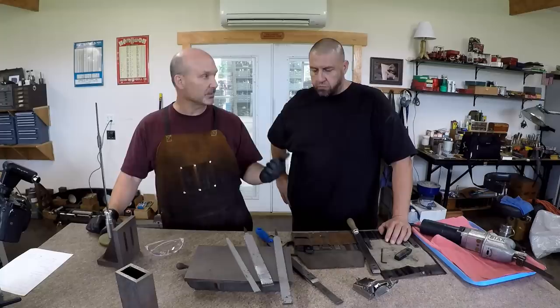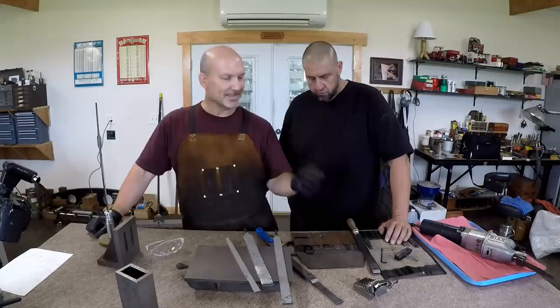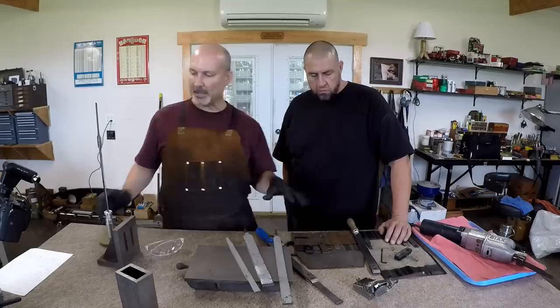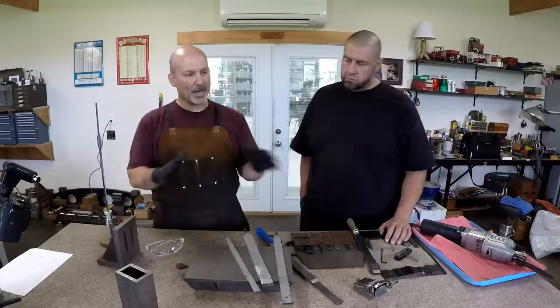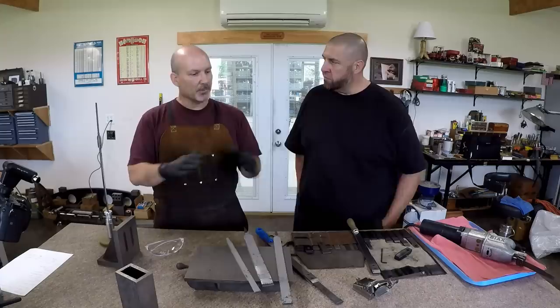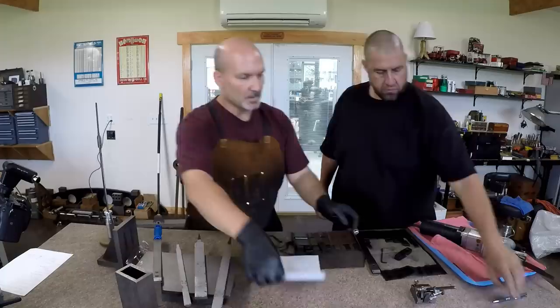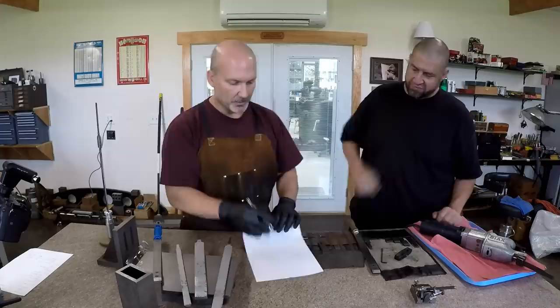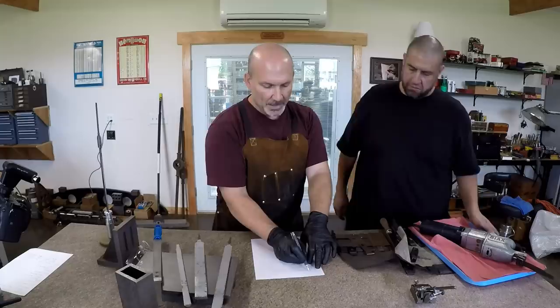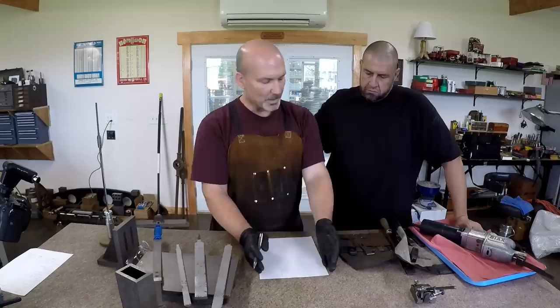As a brief preview, when you look at a blade like this little shorty, it has a smaller radius on it. Traditionally you would measure your part, and I'm going to oversimplify this, and determine where it would need to be scraped. You would typically want to start with a fairly wide or larger radius tool, because it covers a larger scraping area. I'm not an artist, folks, hopefully the screen will pick this up. If you have a very large radius, kind of like the Earth, you're going to have a larger contact area, with less depth of cut over the width of the blade.